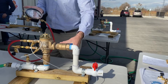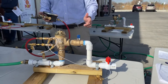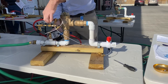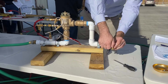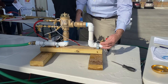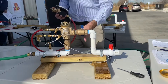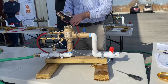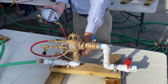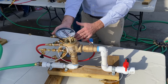Normally you would shut the outlet, shut the inlet, then open the high side. If you have a simulated outlet shutoff valve leak, they would open the outlet valve on the test fitting. You can kind of tell if you have an open outlet because water's coming out — they might have it hidden, but that's a good indicator they've failed that condition. What happens is when you go to do this test, instead of opening high, when you shut the inlet the pressure just starts dropping, so you want to go ahead and get the air inlet opening point while that's happening.